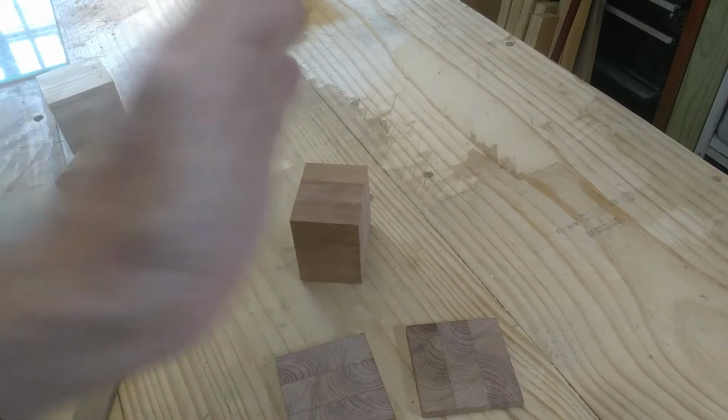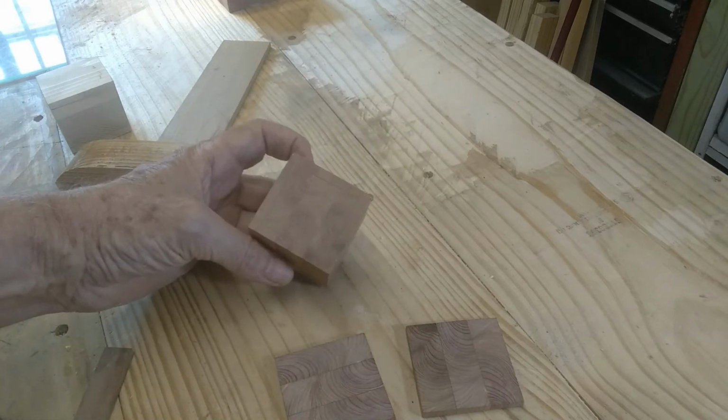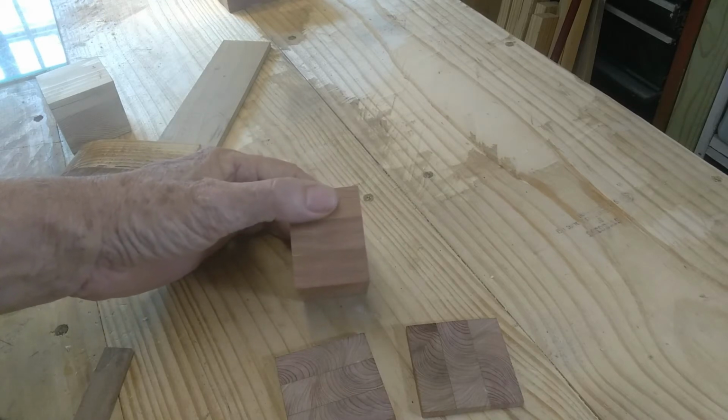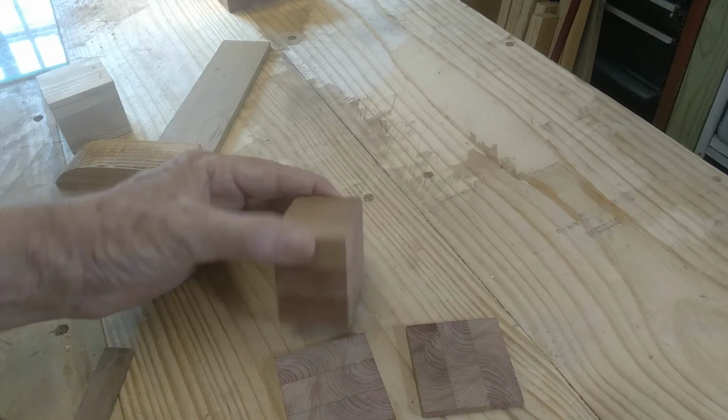from one side to the other. The blade didn't come through directly up and down. It wanders through that thick material. It's hard, fairly hard material, and the grain affects it in different ways. A little thicker blade won't give as much through the material, but I like the smallest kerf I can make also.